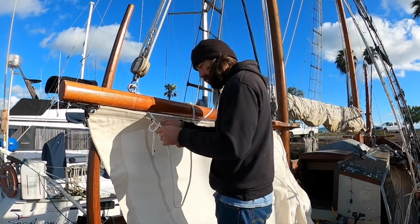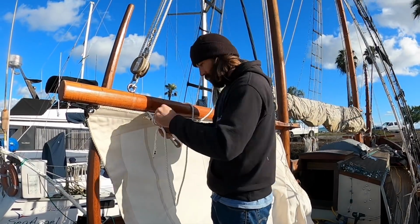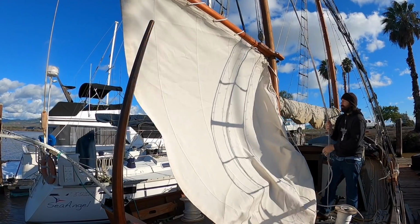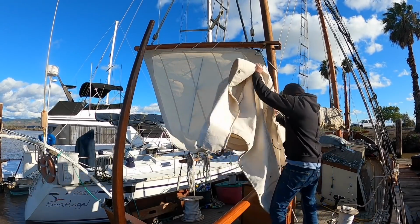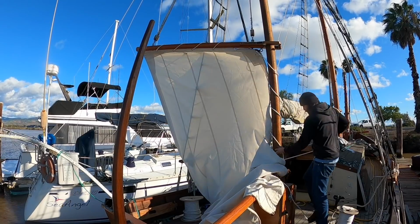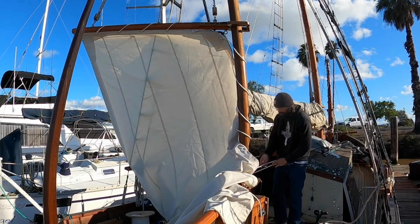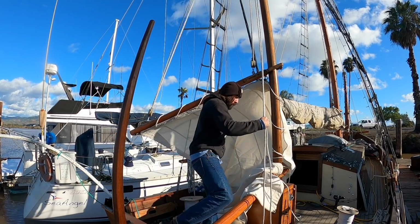The lacing of the head around the gaff is spliced at both ends. We're also lacing the luff to the mast, semi-permanently, but eventually we'll use our parrel beads, but they're a little more time consuming. This way is faster and we can sail like this until we feel ready to dedicate the time to string and splice hundreds of beads. The wind then picks up, leaving this to be finished another day.